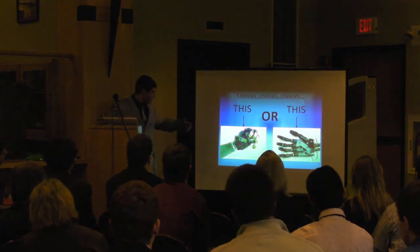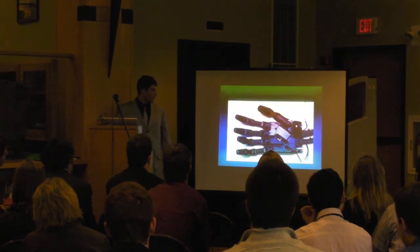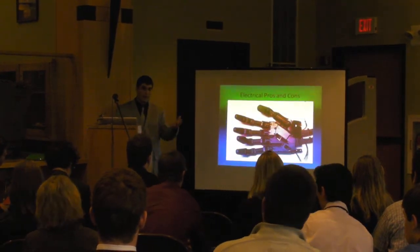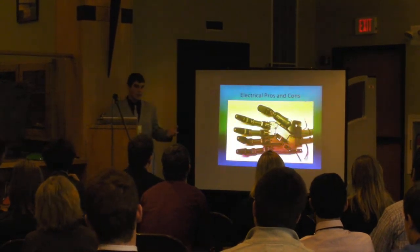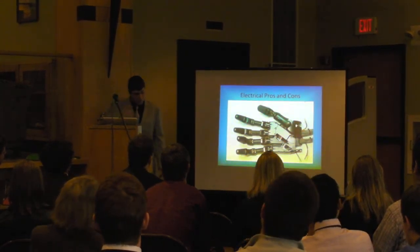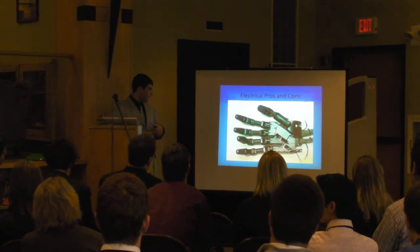My choices were I either go mechanical or I go electronics. Electronics are extremely expensive, so I opted for going mechanical, which I have the tools and the ability to make. Electrical prosthetics can function each finger individually, which — going off the evolution of the human hand — we've learned how to pick up an object with our entire hand. We don't often use just two or three fingers. So having a functioning prosthetic that moves one finger, say for typing, is very ineffective and patients do not like it. The main pro that mechanical prosthetics offer is comfort, because it actually sits away from the stump and doesn't rest on it — no chafing. It's actually called suspended, so it provides a lot more comfort for the patient.